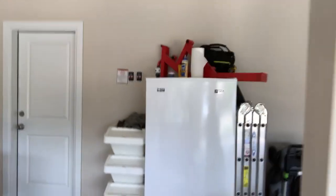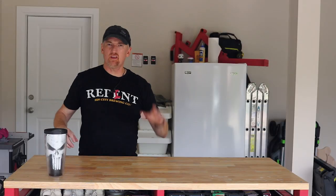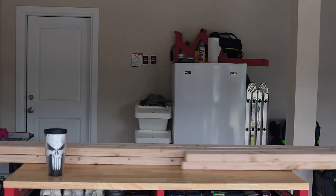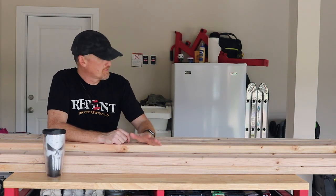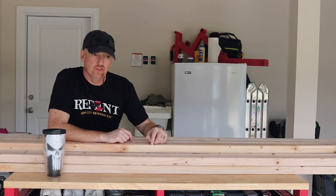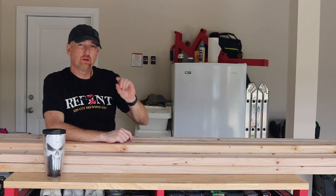I got to build a box. I'm gonna build this box completely out of two by fours. I picked up eleven eight-foot two by fours that I'm going to knock off the edge to make them about three inches wide, and then I'm gonna resaw them in half and make them about three-quarters of an inch thick.